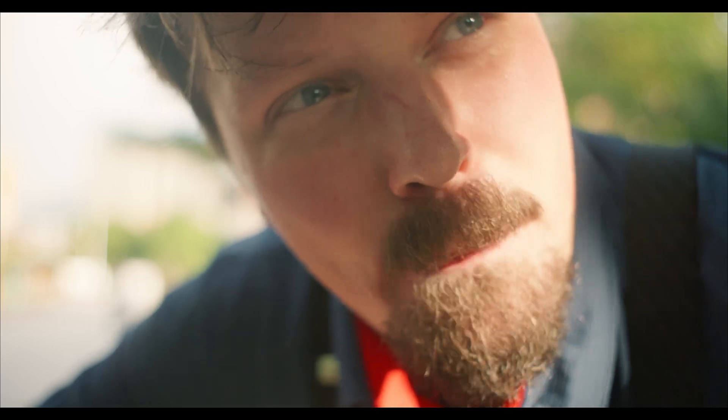Hey guys, it's Dr. Quads. I'm talking so close to the camera here just because I don't want to have to change a bunch of things. I got one last battery to fly, but I'm very impressed with the performance of these tri-bladed props, and the flight time is pretty fantastic. I think I'm going to bump up the master multiplier and the D-term just a little bit to see if we can handle some of that prop wash I was getting on really extreme power loops and things like that. One big problem, though — the VTX doesn't seem to be cooling itself as much as I would like. In the very beginning, I tried getting a shot so I had the air unit on for about two minutes, and when I started actually flying it was saying core is 71, and near the end it said it had overheated. So I landed, let it cool down, and cut a little section on the top that was blocking some airflow. Since then, it hasn't given me any temp warnings.